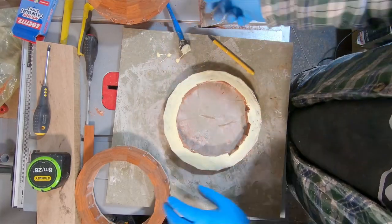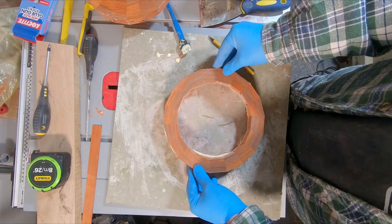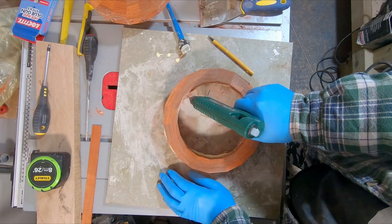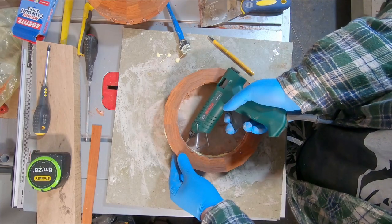Finally the base section — five rings and the solid base piece, again each one glued with Titebond II and held in place with hot melt glue. I thought I might have trouble with the hot melt glue getting between the rings, but I think the wet wood glue solidified it before I had a chance to cause any problems.